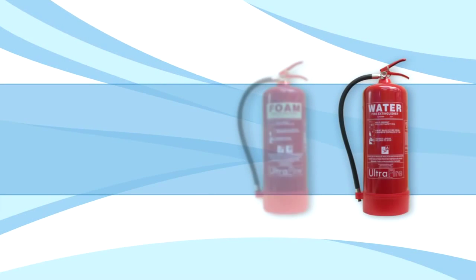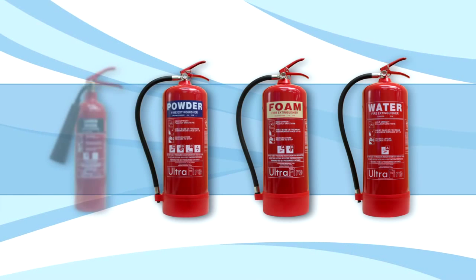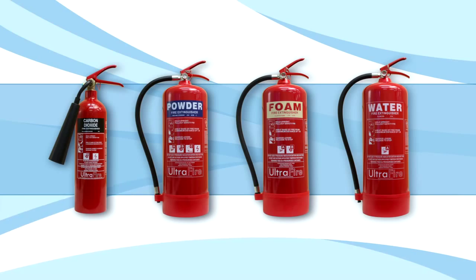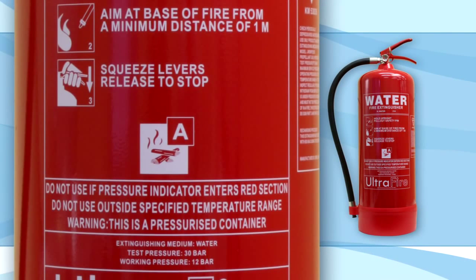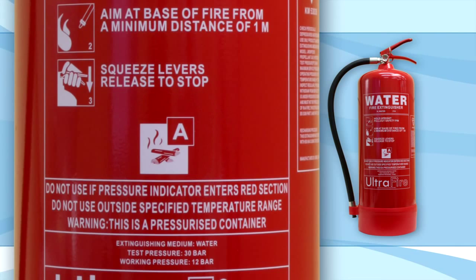As you can see, many fire extinguishers can be used on more than one type or class of fire. The important message here is simply not to use an extinguisher on a type or class of fire that is not indicated as acceptable on the extinguisher. For example, a water extinguisher, which is only suitable for Class A fires, that is, fires involving ordinary combustibles, should never be used on fires that involve a live electrical source.